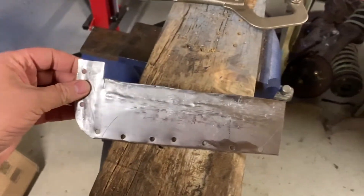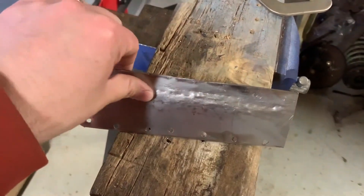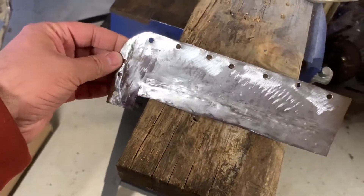I think I did the best I could for it — I think it worked really well. It's not pretty, but once it's in there and welded up, I'll be able to go back in and hammer it out and smooth it out. On the backside, I'm going to spray on some Weld-Through Primer because I'll never see it in daylight again, so I want to make sure it's nice and protected so no surface rust starts to form. So I'm going to grind the back down, apply Weld-Through Primer, and spray it up.